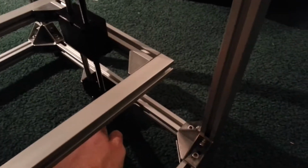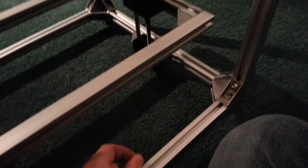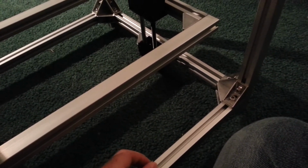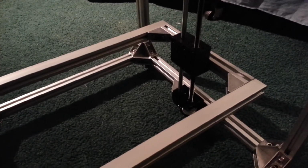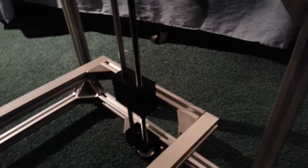And on top of that, the drive motor is going to have a 20-tooth pulley going down to 36, so really it's going to be about 0.75 millimeters of travel per stepper motor rotation, which is going to be awesome. I believe it's going to be slightly more than the 2-up currently. Maybe, actually it's got to be more than that. It's got to probably be about twice as accurate in the Z-height, which is going to be great for printing at high resolutions, very, very low layer heights.